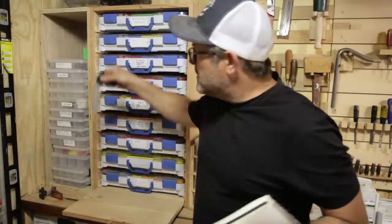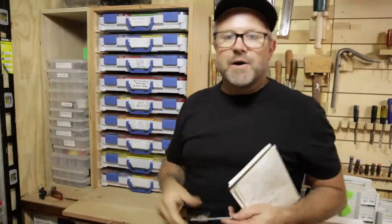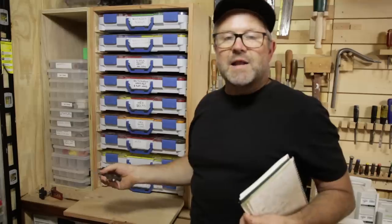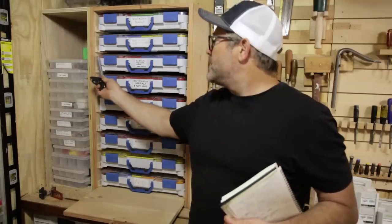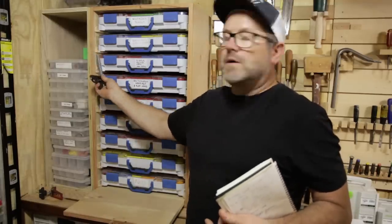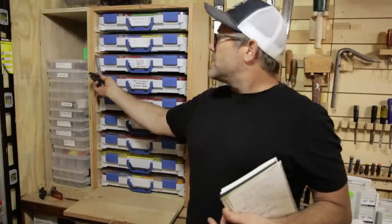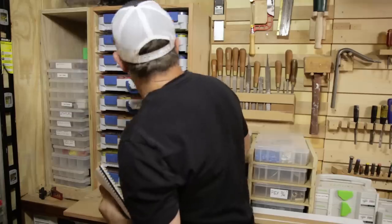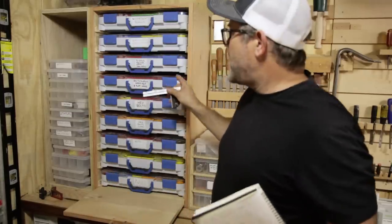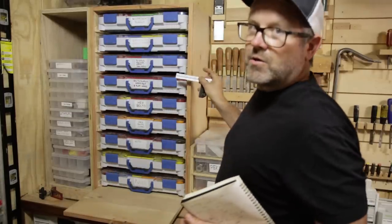The pieces I use for the runner are an inch vertically and three-quarters of an inch horizontally, and I left each of the sides a quarter inch thick. The gap between the top of each cabinet and the runner is one quarter inch, and the gap I left on the sides — the total gap — is also a quarter of an inch. Those guidelines should work no matter what kind of cases you use.